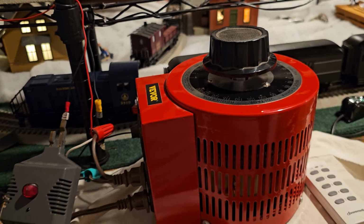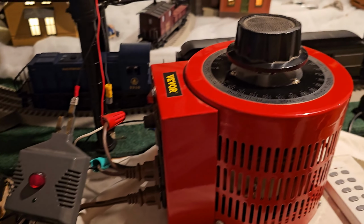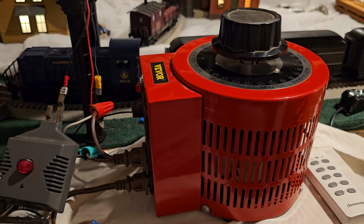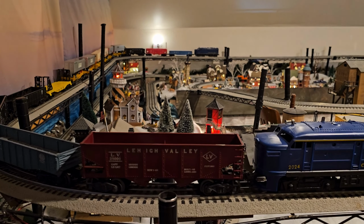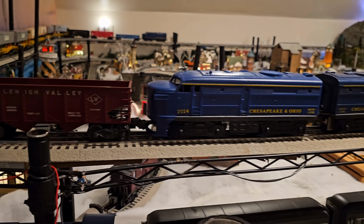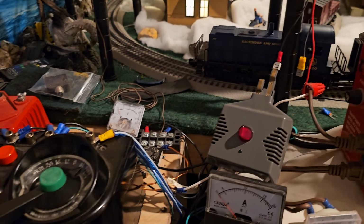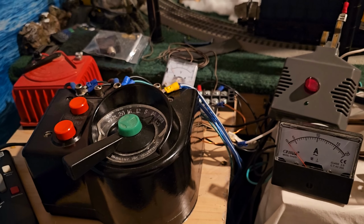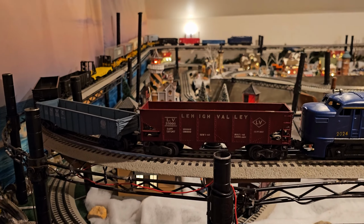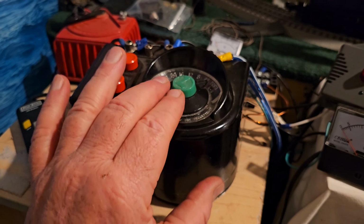Now, you may or may not have paid attention to my channel, but I originally got this because I was running multiple locomotives on my track. I had an uphill, and when the amperage started getting around 6 amps, the KW transformer I had at the time started popping its circuit breaker. It was more than it could handle. I mean, it could handle it for a short period of time, but continuous, it would bust that circuit breaker. Well, then I got a bunch of these.